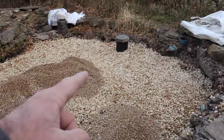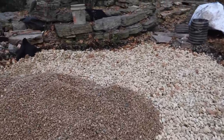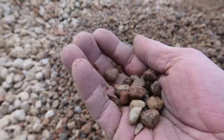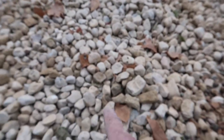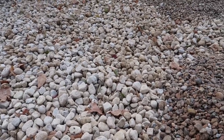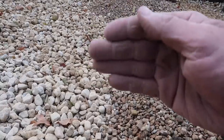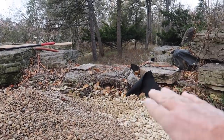We're in the finishing stages. We got our inch-and-a-half down and now we're coming in with three-quarter minus. This is going to be a really good planting medium and it has a higher surface area due to the amount of small pieces. The smaller the pieces of gravel, the higher your overall surface area — and when it comes to biological filtration, that's the key. The inch-and-a-half spreads the water out, allows sedimentation and good water flow, then the three-quarter gives more polishing action on top. The key to a successful designed wetland filter is aqua blocks on the bottom for a big sedimentation area, then progressively smaller grades of gravel going up through the different gravel profiles, giving us better biological filtration. Our goal is to fill it up to the right level, have a little standing water, and then our waterfalls will dump out from there.